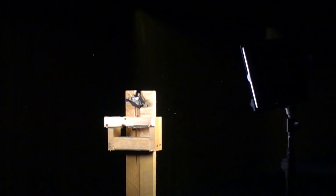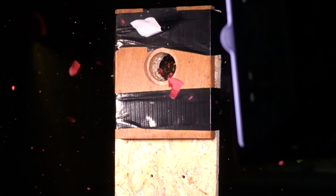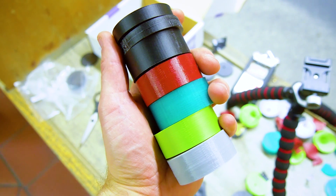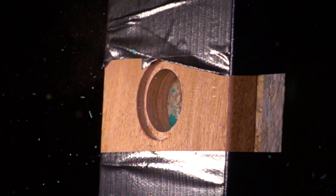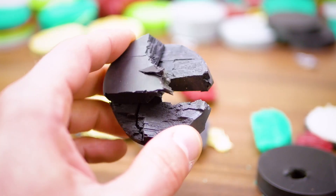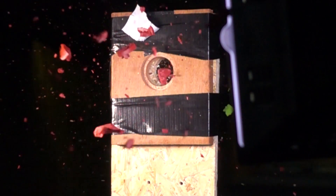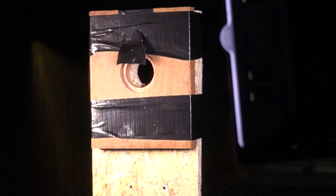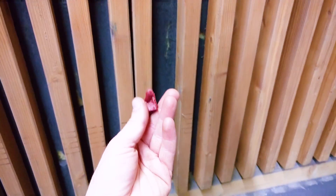Stopping there would have been pretty lame, so with the second set of parts, let's see what the .45 can do. This is a much larger and heavier bullet and it's going to be carrying about three times as much energy as the .22 we just used. I think even the fiber parts are going to have a much harder time, but we're going to start out with the regular 3D printed plastic samples, skipping right to the 20mm thick ones. Not surprisingly, even the thicker ones weren't able to stop the .45 caliber bullet. It smashed right through the PLA and PLA plus parts and took a sizable chunk out of the ABS sample. We see that tunneling effect on the PLA plus and a nice indentation where it hit. The PETG part got completely obliterated and while it looks like it actually took quite a bit of energy out of the bullet and scraped off bits of the metal jacket, it did not stop it going through.